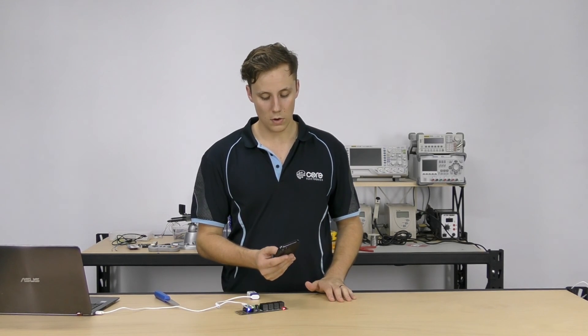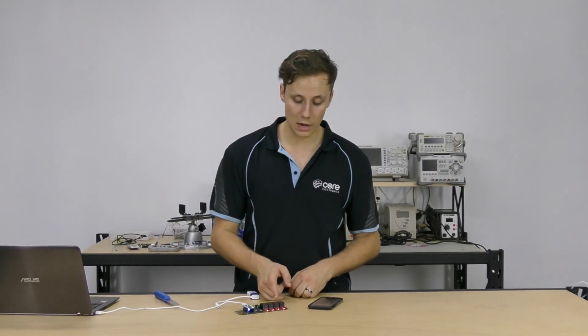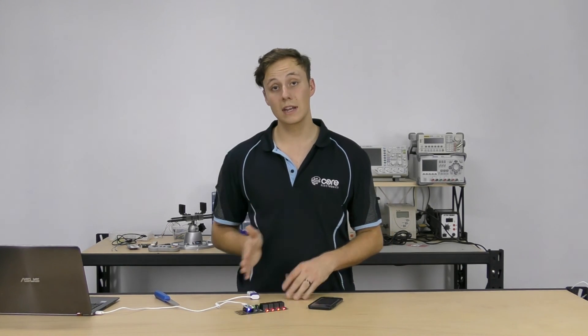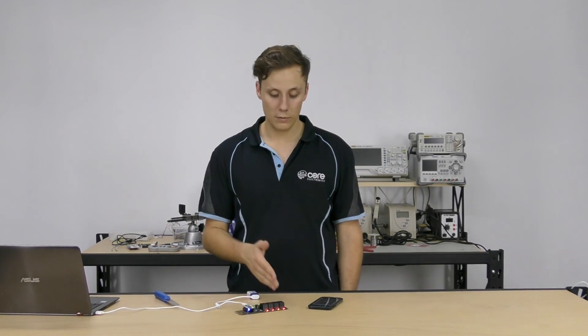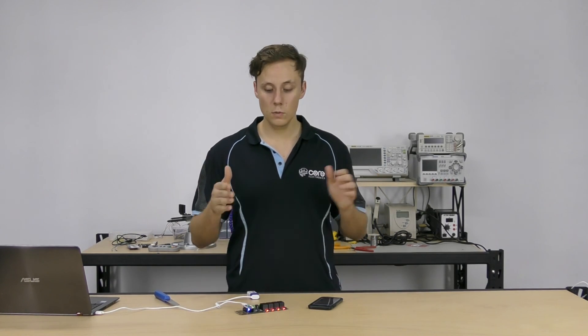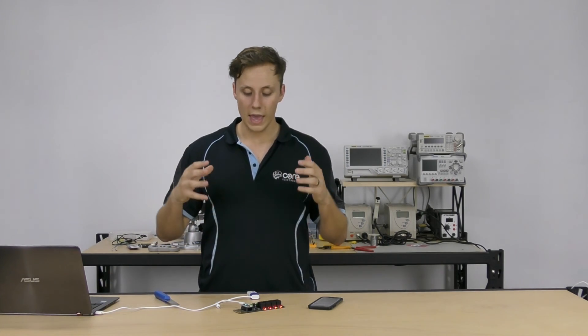That's all for today guys. We can see that when I turn these on they all turn on - you can connect whatever you want up to there. In the diagram they show connecting a light bulb but bear in mind they're showing that with mains power, so be very cautious - I wouldn't recommend doing this unless you are a licensed electrician. But you can use it with LEDs: connect the center pin up to 5 volts, connect the positive leg of your LED to there and the negative lead through to ground via a current limiting resistor, and whenever that contact is made it will turn the LED on. Connect motors, connect whatever you want - it's fantastic. I think they're only about 54 bucks - great value. That's a bit about relays, solenoids, how the coils work, and a lot about this fantastic relay board from Particle. See you next time guys!